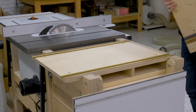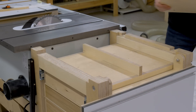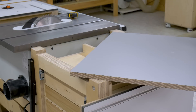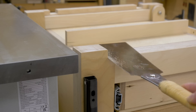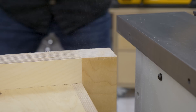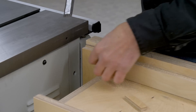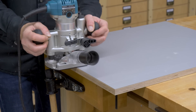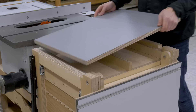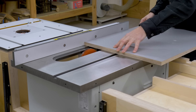I'm going to change the sliding carriage base. This time I'll make this part a little bit wider than the last, so I'll have to cut part of the bench frame. I made a chamfer with a 45-degree bit on all edges of the HPL board. I marked the position of the miter channels and machined them with a table saw and a dado blade.